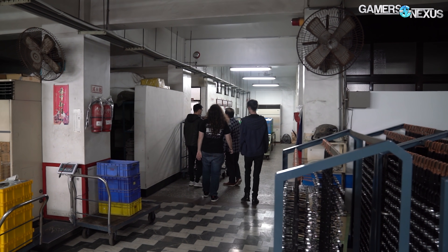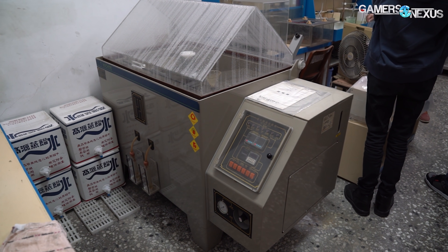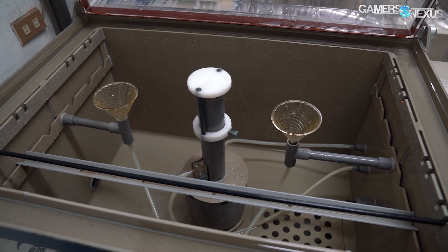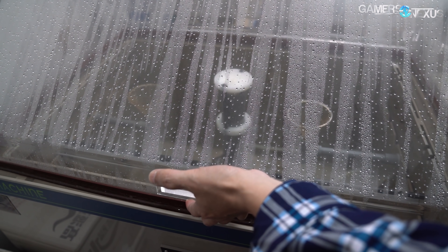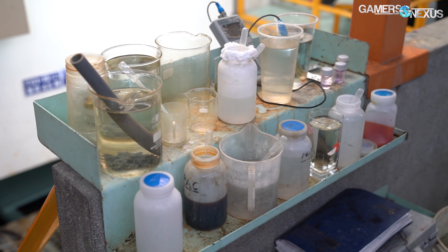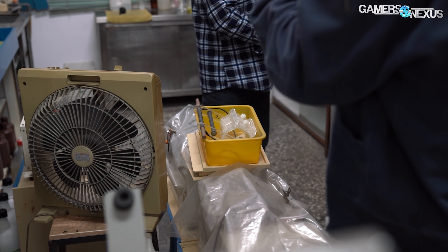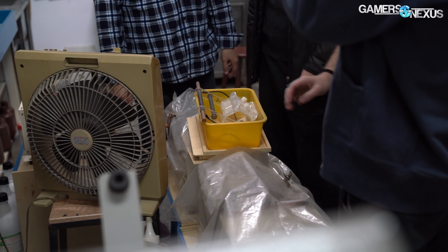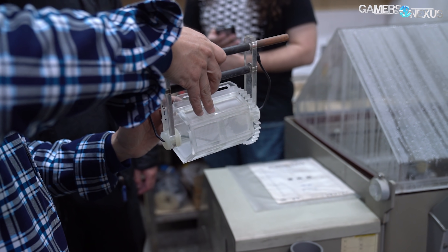The more complex part of QC is the room where the factory does stress testing, as well as internal QC of its own manufacturing process. A salt spray tester like the one seen in Cooler Master's factory is used to test the endurance of protective coatings on things like diving gear and scuba gear subjected to harsh conditions. The degree of testing is up to the customer — some might accept corrosion within 24 hours of salt spray testing, while others might disallow any damage ever. This is also where the mixture of chemicals used in electroplating and filtering must be checked carefully every day, and where a tiny transparent version of the electroplating drums is used for prototyping.